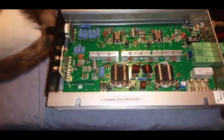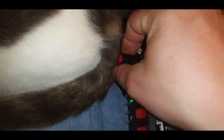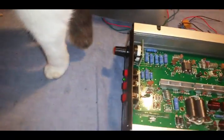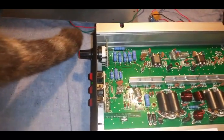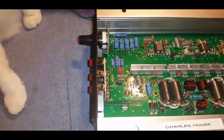A 30–40 amp supply will do it for this one. The radio I'm driving it with is still considered over the max it should be driven by specs — it says to not drive more than about 8 watts into this thing. But you do have six positions which are input pads here that you can pick from. If you do have to drive a bigger radio into this, I suggest turning this anywhere from position 4 up. I would try not to drive more than around 14 watts into it; I'm going to be driving 20 PEP, 4 watts RMS.